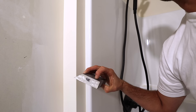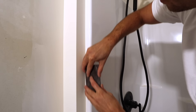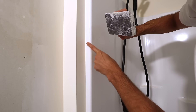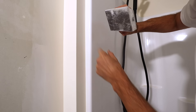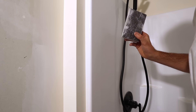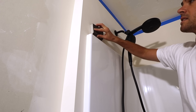You just want an angled sanding sponge so you can get right into that corner, and then carefully sand this edge. Don't press it hard against the flange because you'll scratch it — instead of being glossy it'll have a duller sheen, and we want to keep it glossy. So don't press against the flange, just inside the corner. We're kind of just carving out a little spot for paint and caulking to bridge that gap.